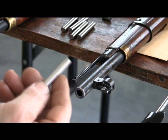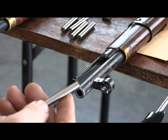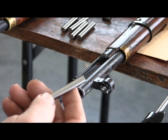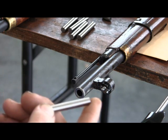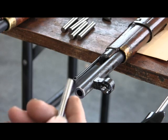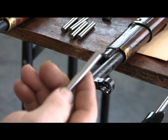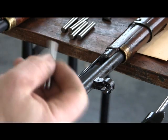What I have is precision gauge pins — a machinist thing. You've got to get these in a machine shop; they come in a set. These are precision ground pins, ground within tenths of a thousandth, which is why they're called gauge pins. This one is marked 300 thousandths — this is a 300-thousandths gauge pin.